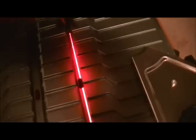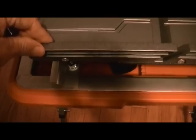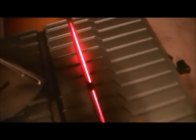So you're not going to be able to really rely on that laser, and I never really have anyway, because obviously you can't adjust anything that has to do with the arm. All you could probably do is adjust the laser beam itself. I haven't looked at that. The other problem is already this table moves just slightly. Okay, so that's probably, I don't know, a quarter of an inch or so that this table moves. There's no way to tighten this table from what it is already. The rollers are what they are, and they're locked in there. And the tightening of the rollers are these nuts right here, and of course that's been tightened already. So with this movement, you cannot guarantee a straight cut every time, which is okay. What I would be used to anyway is passing the tile through the blade with the line that I marked on the tile rather than the laser. So I'm not even going to worry about the laser at all, but I'm just saying that's what you get for $300.